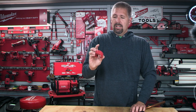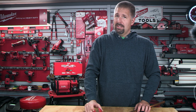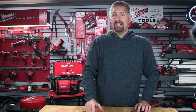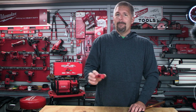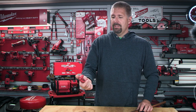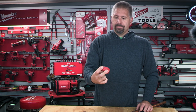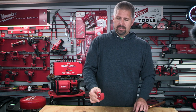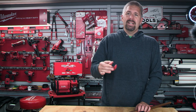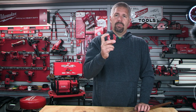These are a really good tool to have. I don't know if you can use them on EMT — I think I should try it. I'm an electrician so I should have a piece of EMT. I don't know if it will ruin the blade. Here's the thing though: if you use them for EMT, you'll have to only use them for EMT. If you're going to use them for copper, use them for copper, because it's going to mess up the blade. If you're in a hard-to-reach spot and you have to do some remodeling where you need to cut your EMT pipe and make a small incision, then just use these for EMT only.